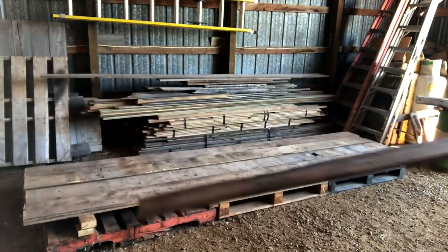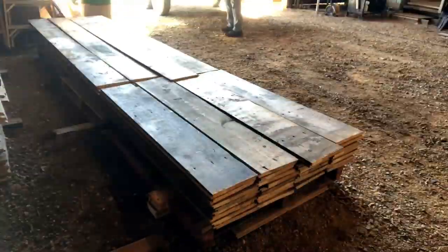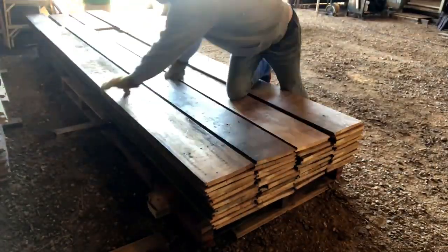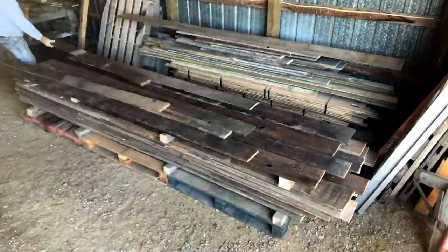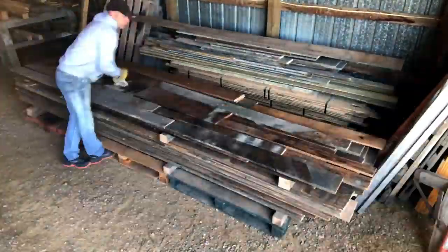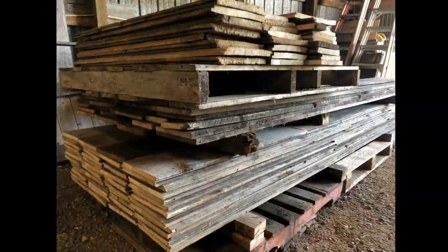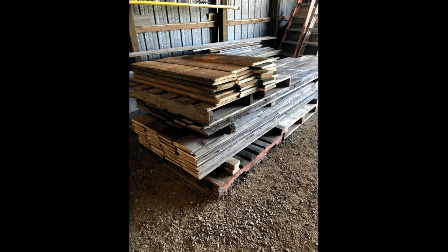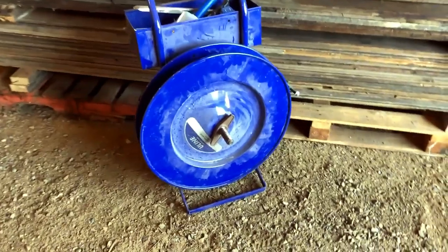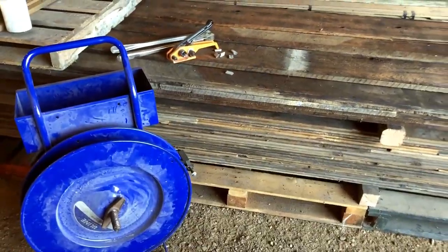The first stack we're making is all the boards you saw on the trailer — we're able to make a nice rectangular shape, which is great when you band them and go to transport them. The second level is our red cedar; you'll notice there are all different lengths, so it doesn't stack as nice. If you have access to equipment like a forklift or skid steer, that makes it so much better. If not, be very careful where you stack it because you don't want to move it again. This whole barnwood game is all about manual handling — the more you can reduce that, the better. We've stacked it so it can easily be transferred onto a trailer and banded there.